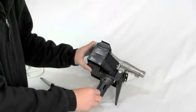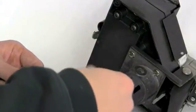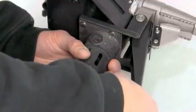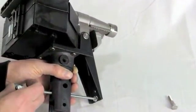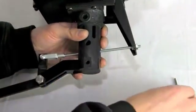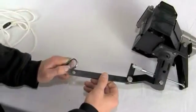To install the clamp actuator, first remove the bolt from the handle. Then unscrew the two lock nuts from the threaded rod. Insert the threaded rod through the handle and attach the second lock nut to the threaded rod. Attach the adapter arm to the handle and insert the bolt. Finally, attach the rope hook to the handle.